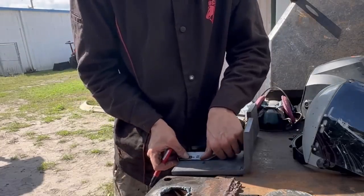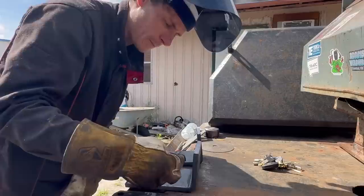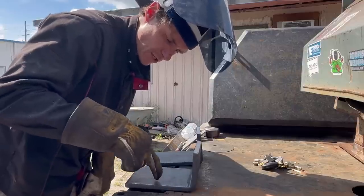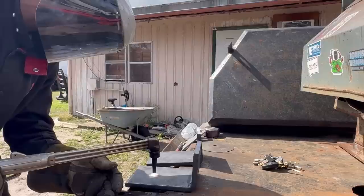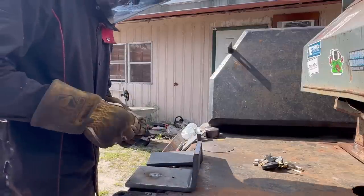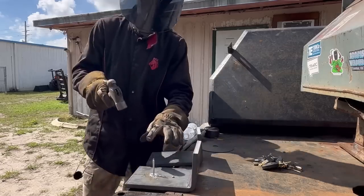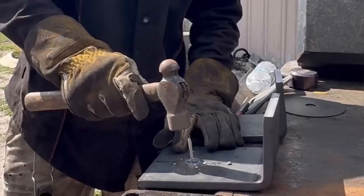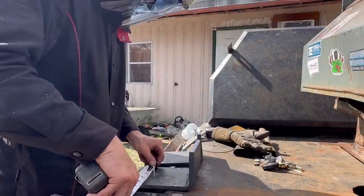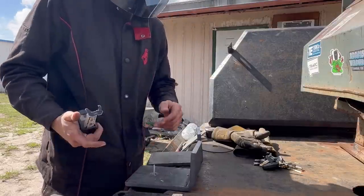Of our hole. So I'm gonna do something a little different in order to get my circle. I don't have anything that's 2¼ laying around. So what I'm gonna do is pop a hole in it, stick this welding rod in the center, and then get a string and use it to trace the circle around with the string. Perfect that way, and perfect that way.